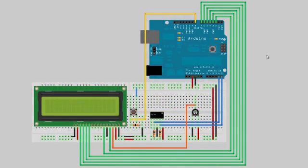All right, here are my plans for our revisions to our system to add a temperature sensor and a nice little readout. We already have these green lines hooked up for the LCD. These are the data lines and the control lines over here. We already have our pot hooked up. What we're going to add is a TC74 I2C temperature sensor. We used this in previous tutorial number 7, where we learned about I2C communication. So you should already have this part, hopefully.